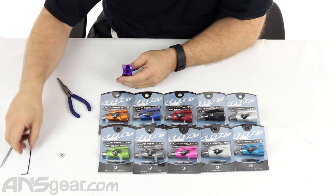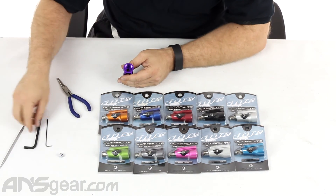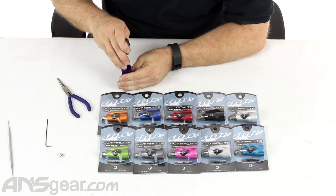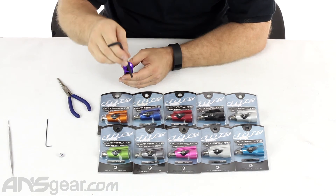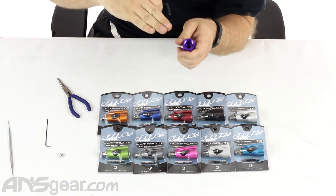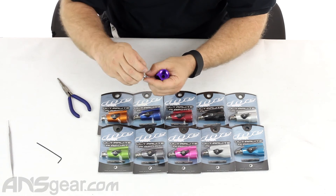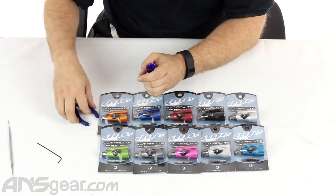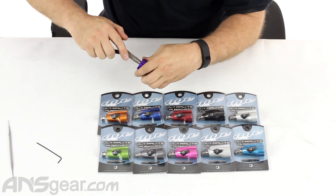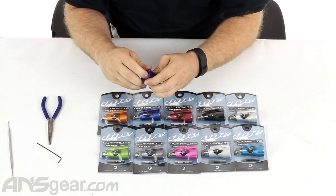So first thing we're going to do is take our small O-ring. The small O-ring fits into a little recessed area at the bottom. It can be tricky to get in there, and you don't want to damage it. So if you take an Allen key that is wider than your O-ring, you can just pop it right down into place. You can use a pen or something that's just bigger than the O-ring itself so that you can evenly push it down into its little groove. Then we take our core, make sure that we've got our pin in properly, drop it inside, push it down, and screw it together to where it is snug — don't overdo it, just snug. And then we're going to activate our cam to make sure that our pin moves back and forth freely and easily.